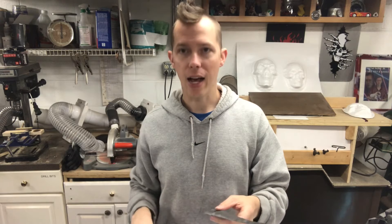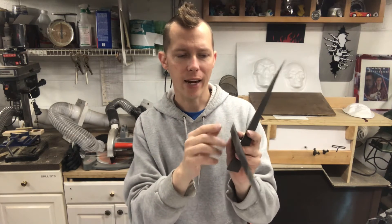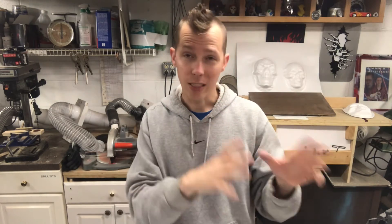I've been working on the horns and crowns. I resawed them on the bandsaw to get a nice steep angle, then came back on the belt sander to get a really nice edge so when I glue them together they meet up well — a nice sharp point. I need to contact cement those, then cut the dome template. The cement needs to drop 15 minutes — it really is the best way, not getting impatient. Baseball playoffs yesterday — I had my money on the Cardinals and watched them blow a 2-0 lead; the Phillies scored six runs and couldn't stop scoring. The Padres weren't nice to Max Scherzer either, but I want the Padres to win so I wasn't all that upset.